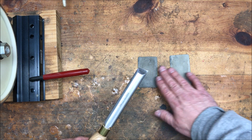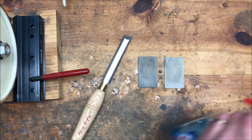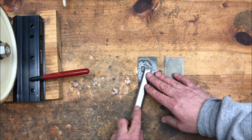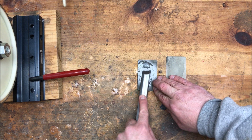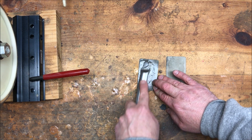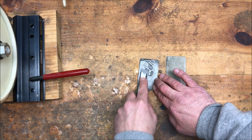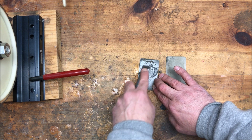What we want to do now is use a couple of card files and work that burr back and forth until I can actually work it off of the tool. I'm going to use a little Windex — I found that Windex works nicely as a stropping fluid. I'll put a little bit on there, find the angle, hold the skew at that angle, and work it in a circular motion on the card file. You don't have to get in a hurry — this isn't a race. Don't try to go super fast. Just take your time, work that angle, and flip it from one side to the other.